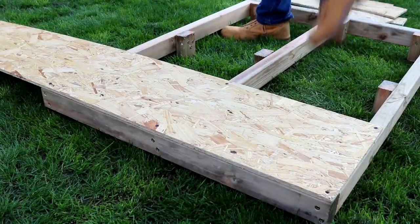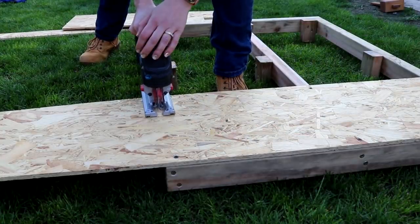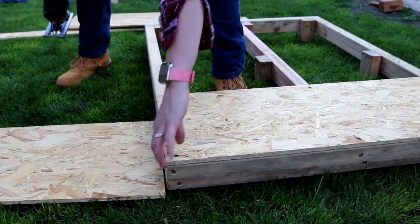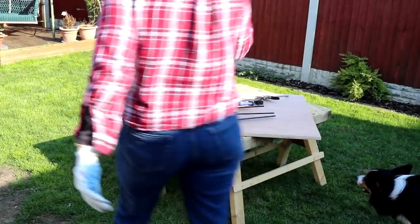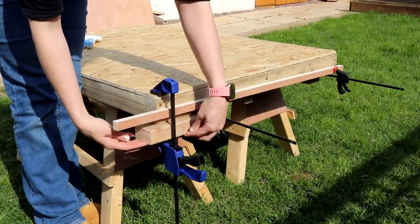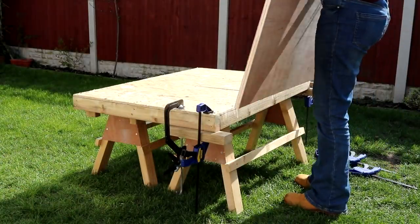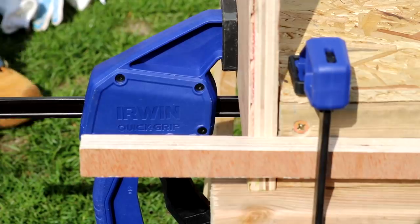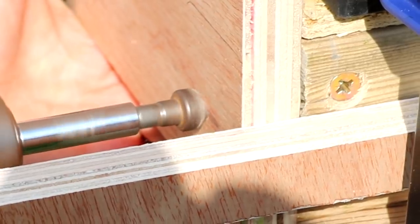To give the base some flooring I had a few strips of OSB left over and screwed them directly on top, butting them together. I used the Erbauer jigsaw to trim off all of the excess as I went along, making sure nothing protruded. I then popped the base on the saw horses, got creative and clamped some offcuts directly underneath and either side to use as a shelf or lip to rest my panels in place accurately and then screw them to the sides. A strip of plywood was used as a stopper so nothing protruded either.